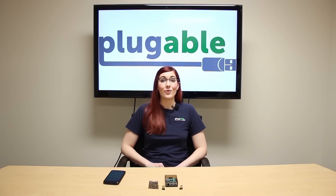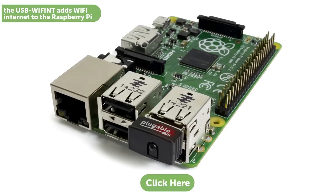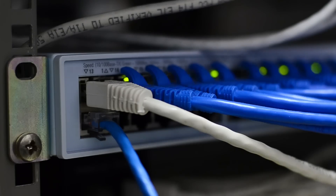The Bluetooth SIG just released a Bluetooth Low Energy Gateway example project using the Raspberry Pi, and it works very well with the small pluggable USB-BT4LE and Wi-Fi adapters. The sample gateway project contains two servers: a front-end web server, which responds to user requests and routes those requests to the corresponding handlers at the gateway server, and the gateway server, which interacts with target devices in range using our Bluetooth dongle and handles all the low-energy read and write requests. The complete project with documentation and files is available from the SIG.